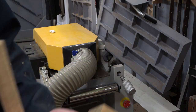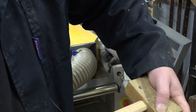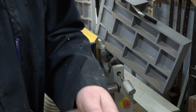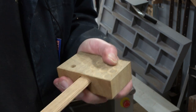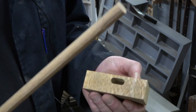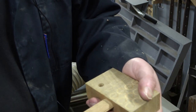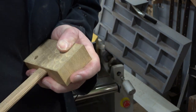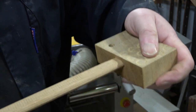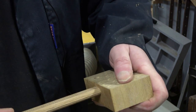Let's have another test fit and see where we are. This is at 10.1. That is a good fit. I know it's supposed to be a 10mm domino but it's always worth just sneaking that fit in — and that is a good friction fit, which is what you would expect. I sometimes prefer to take another hair off that just so that it's not quite so tight. Even now, putting that in twice has just kind of bruised the fibers to the point where it's sliding in a bit easier. But that is lovely — you can hear that as it hits the bottom. Nice.